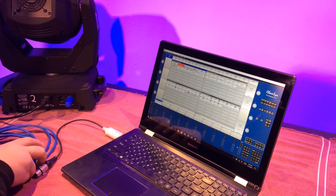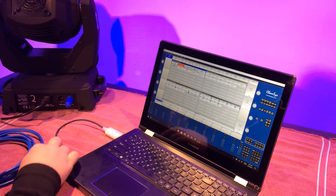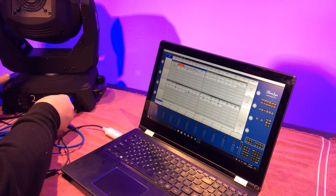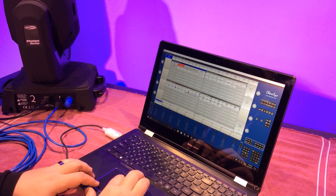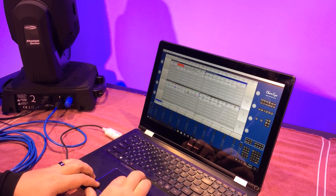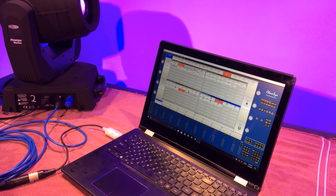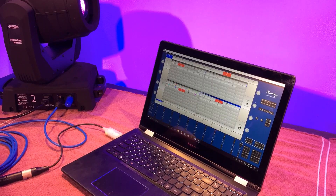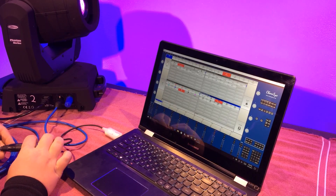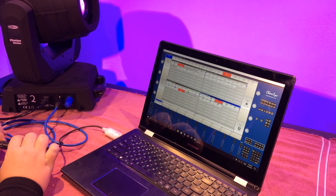Now that you have your cable created, what we're going to do is test it. We're going to use a lighting controller and a lighting fixture, so we'll just connect the cables together. As you can tell, the light spun up and we're just going to test a few functions to make sure that it's working. Looks like everything's working. You want to make sure that you test your cable and make sure everything's working with your connections before you sign off on the cable. The nice thing I like about CAT5 cables used as DMX cables is that if you have something go wrong with the connection, you can just cut the end off and re-solder it back in — it's pretty simple and easy to do.